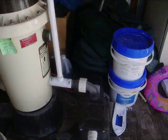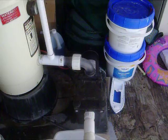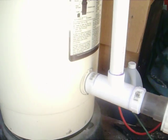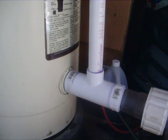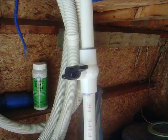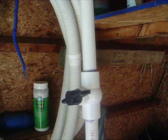I'm going to show you this connection right here. This is my DE filter and the pump is right next to it. You can see that the pump has a connector with a T in it — basically about a one-inch PVC pipe coming off a two-inch T. I branch it up so it comes up over here. I have a valve in it so I can shut it off, so that the water going back into the pool can be shut off here and I can turn off the solar heater if I want.